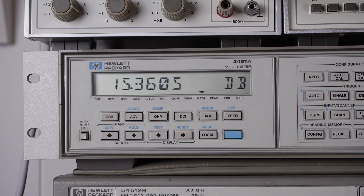So that computes to plus 15-and-a-bit dB, giving us a good 15 dB of headroom — quite impressive performance really. It just seems completely inappropriate for something which is meant to be driving a microphone-level input.